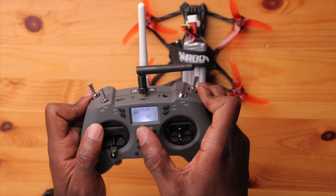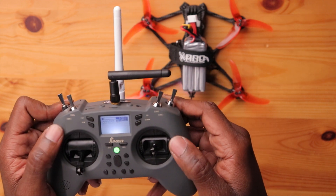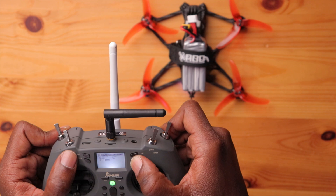Let's go and see if we can turn the power up. It's as simple as going to Systems, then ExpressLRS Tools, and selecting power. We scroll through: 25, 50, 100, 250, 500 milliwatts. 500 milliwatts is the claimed maximum of this module — the maximum that both Jumper and BetaFPV promise from this module. Let's select it and see if the radio stays on.